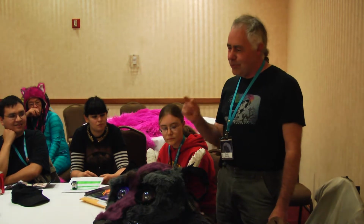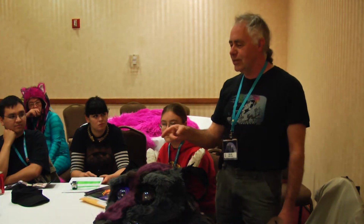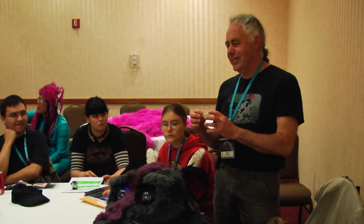So it's really worth the extra effort to make little plexiglass brackets for the motors and things. I've done that for the eyes now, and I've got a lot wiser as I get older. So now I have little brackets for mounting the servos on, and the brackets I glue on, and it's a lot easier to get the brackets off of the servos.